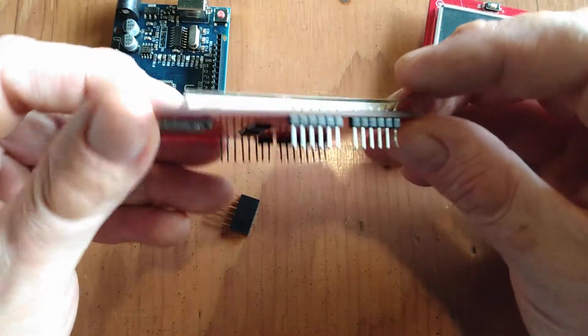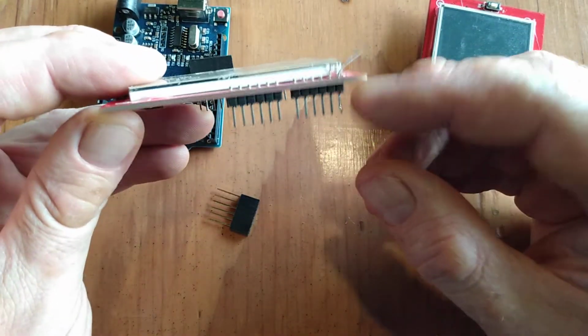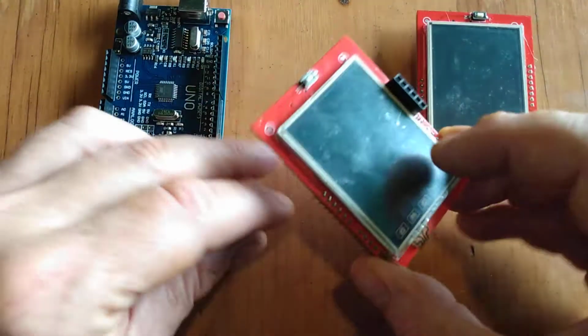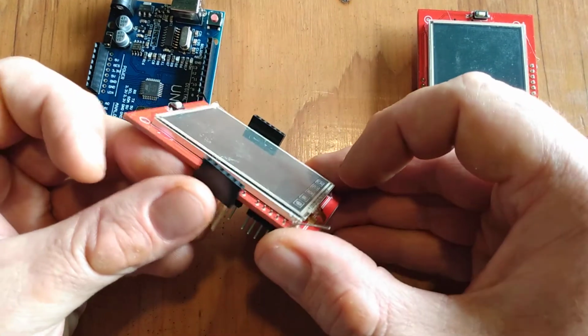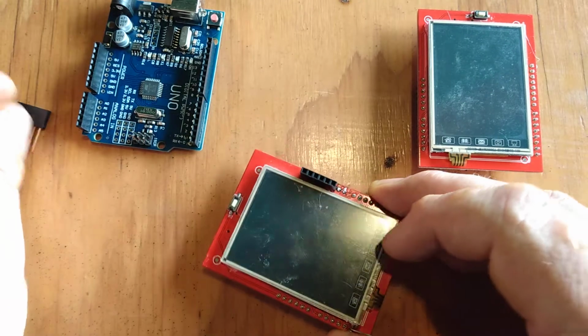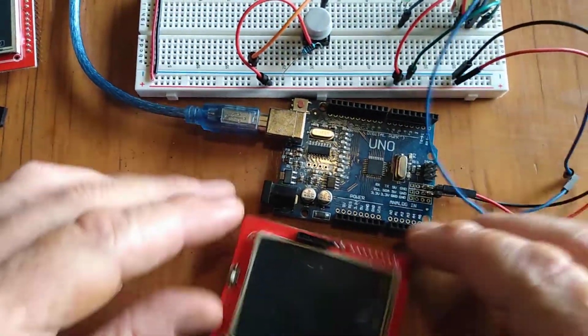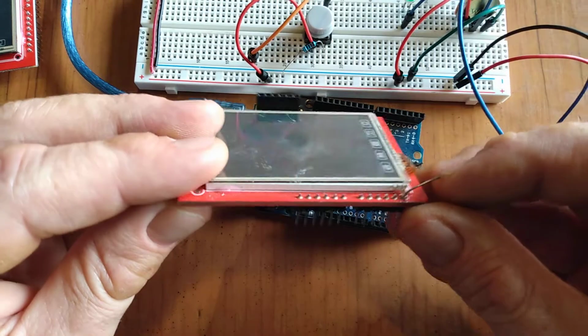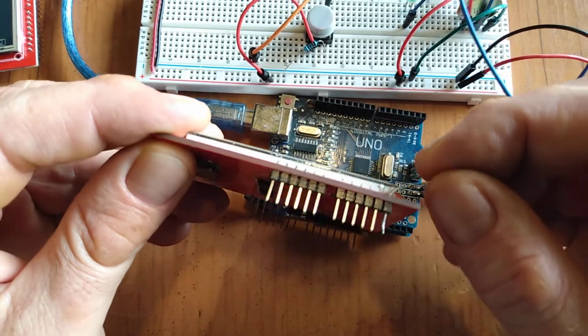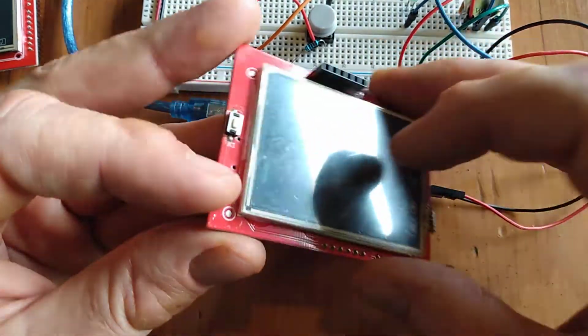And for the analog pin, I just kind of pulled out that last header and grabbed an 18 gauge wire and shoved that through there. I guess this thing would have been good over here as well, still access the ground and power. But it gave access to those Arduino pins. Whoops, bumped my little gooseneck there. I did tie in the power here because right here in the corner, I don't mind having this wire sticking up, but I didn't want to stick stuff up right here. I thought that might get in the way.